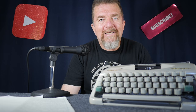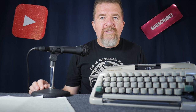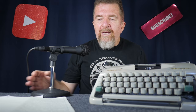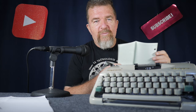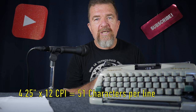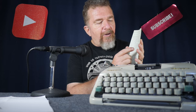Welcome to Typewriter Video Series episode 126. Today is a continuation of last week's episode, which was about how to use a 12 character per inch typewriter and make the imprint appear large enough on your blog if your blog template is fairly narrow. The idea was that taking U.S. size 8.5 by 11 inch paper and folding it gives you a 4.25 inch wide piece of paper, and with a 12 CPI machine that is theoretically 51 characters per line.